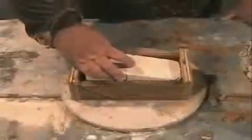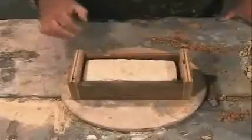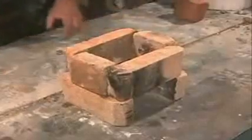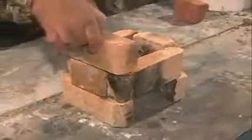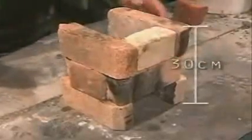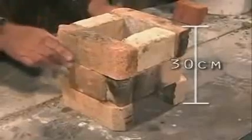Here is the fired brick — it has reduced in size as it was dried and fired. After a bit of experimentation, lightweight, durable bricks can be easily made. The combustion chamber is made with one shorter, heavy brick in the back, which resists abrasion from sticks of wood being pushed into it. The other bricks are placed around the heavy brick. Three courses of brick make the combustion chamber, creating an insulated space above the fire to help smoke, air, and fire mix together so that smoke is burnt up and harmful pollution is decreased.